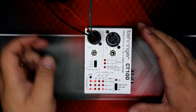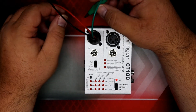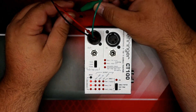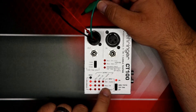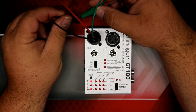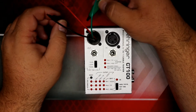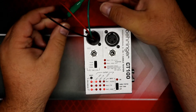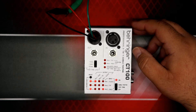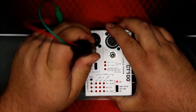You can see pin three and pin one are shorted. The intermittent detection also works — if we tap the connection, intermittent lights show for pin one and pin two on the input side. We can reset it. There's an intermittent connection on pin one and three, for example. If pin one and pin three are shorted to each other, we see exactly that — pin one and pin three are shorted.